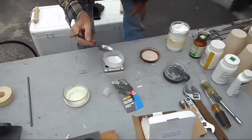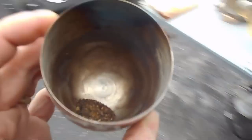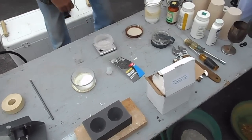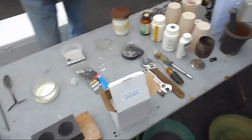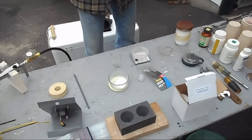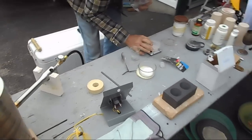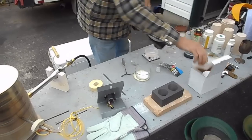Dad's mixing up some really basic flux right now — some really simple flux. We're not going anything complicated. All we're going to do is take a little bit of gold — mostly gold with a little bit of garbage — and try just a simple melt. We're not doing any fancy refining or crazy chemistry; we're just going to do a simple melt. He's making up flux to protect it as it's melting and to grab any garbage that might be in there, tying it up in the flux. We're going by a basic refining flux recipe. Second component is borax silica at 8.25.